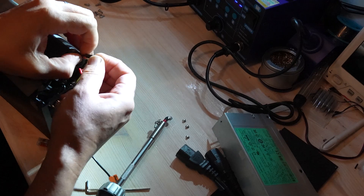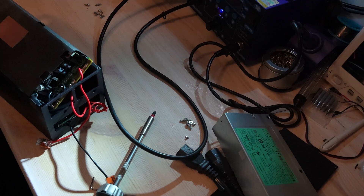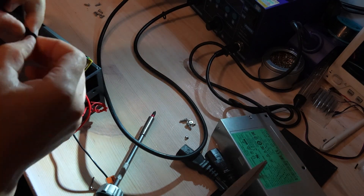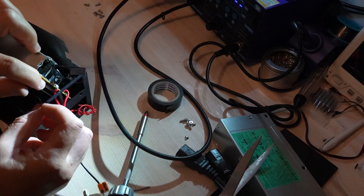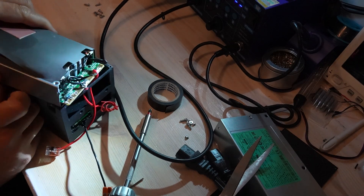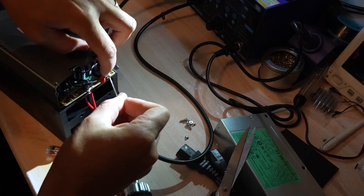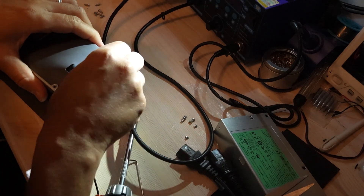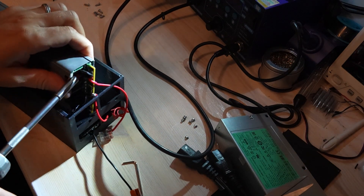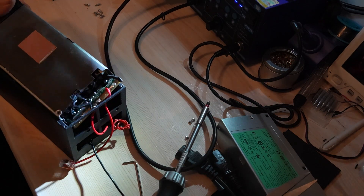Final and safe wiring setup. DC side: the lower PSU's negative output is connected to earth ground and its case is grounded as usual. The upper PSU's negative output is connected to the plus 12V output of the lower PSU, making it float at plus 12V. The upper PSU's case is still grounded for safety, but its output is isolated from its chassis as intended in a proper series stack. This gives a proper plus 24-volt output, no floating voltage on USB or signal lines, and a safe earth reference for the entire system. AC input wiring is safe and clean.